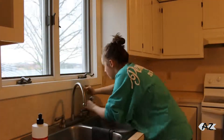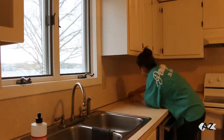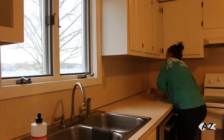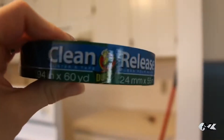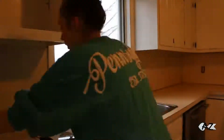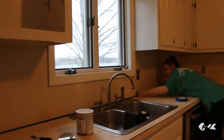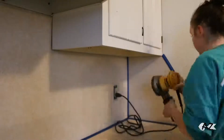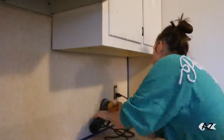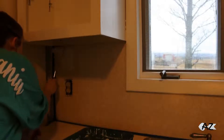I really really scrubbed the backsplash very well with Mrs. Meyers soap, because I needed something to make sure it got all of the grease off the backsplash and any other grime that would prevent the paint from sticking. Then I got this clean release tape from the duct tape brand — it's at Walmart — and that's what I taped off all of the edges with. Then I borrowed a sander from my dad and sanded over the walls. I didn't go into real depth with this; I just kind of went over it, and more or less it probably just got rid of debris rather than really making it scuffed up.